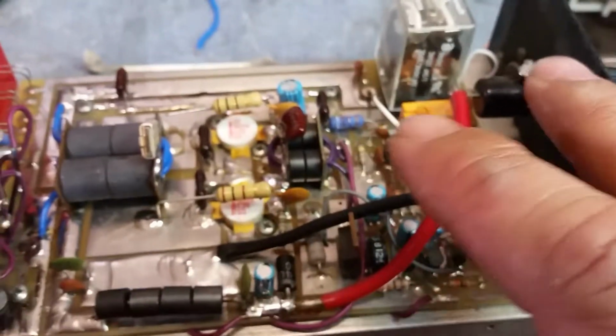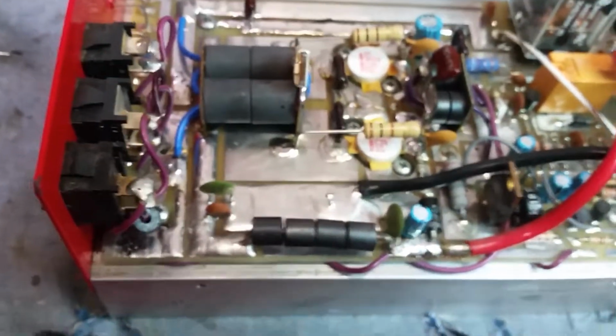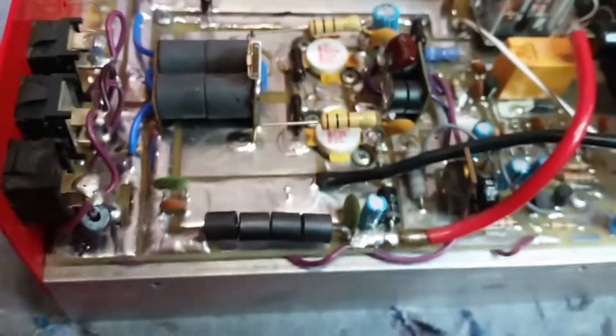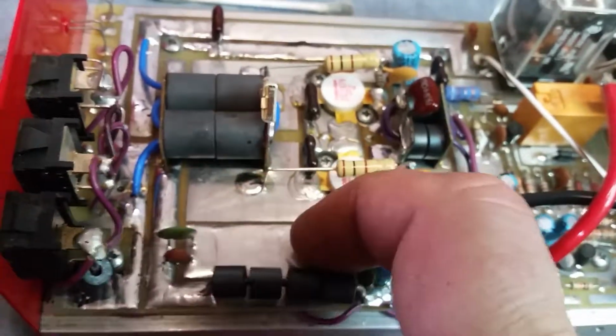Take this fuse out right here to probably help with the power distribution, thicken up on the power wire to 8 gauge. That would help, possibly even maybe soldering a wire from here to the back of the transformer a little thicker. That could be a little something that would help too. I thickened up on the ground solder right here too on the ground pad. Alright, so we got the hot radio hooked up now.